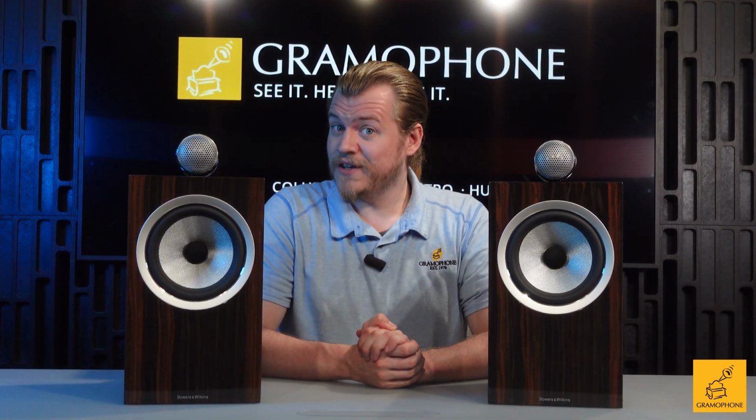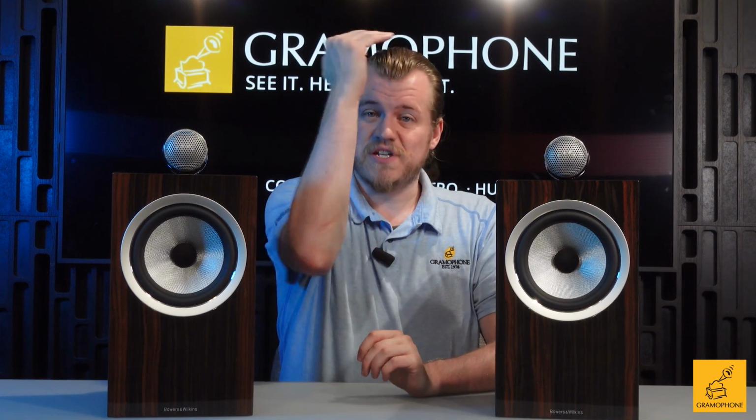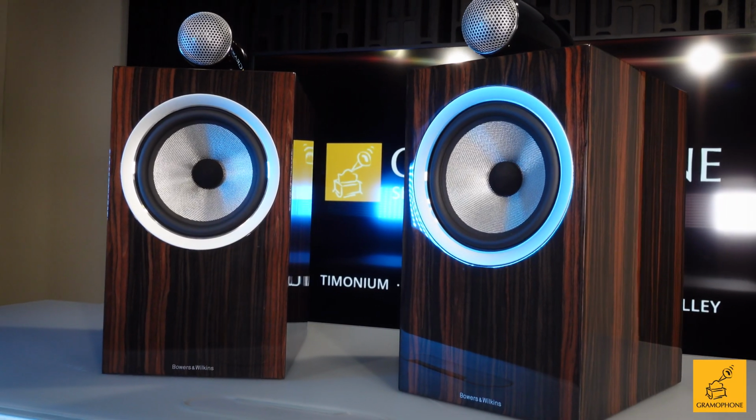And that is a material that works really, really well for tweeters because other than pure diamond itself, like on the 800 series, carbon is the next best thing in terms of making a material that is really, really rigid and really, really light. It'd have to step up to being literal actual diamond to be better, and that is the entire point of the series above this one. However, these tweeters are exceptionally detailed.